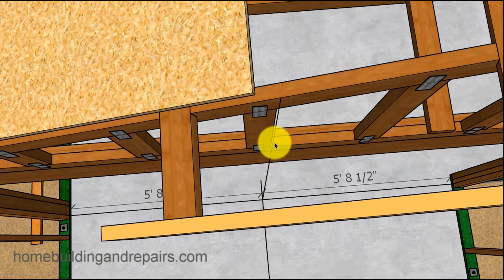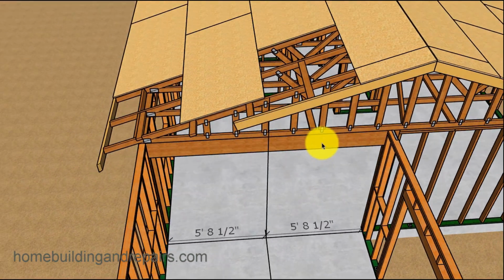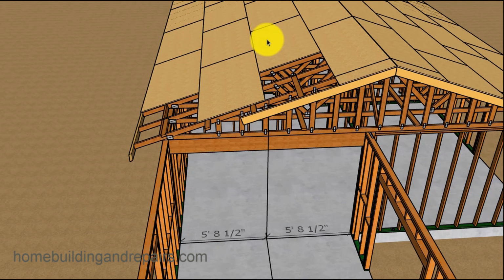We're going to come up here. You can use a plumb bob or a level to find the center up here at the top of the rafter. And again, this is a truss system on this house. Here we have the end truss, the gable end. I have to point out that I've figured the conventional roof rafters for a situation like this, and been disappointed that the roof truss, let's say I thought it was a 5 and 12, was like a 4.5 or a 4 3/4 and 12.